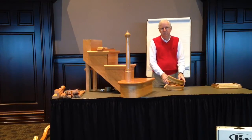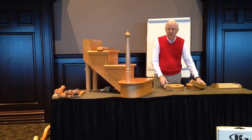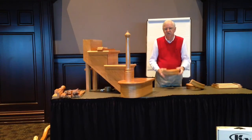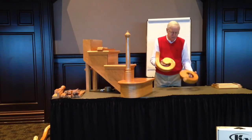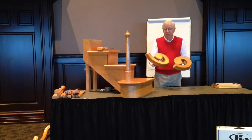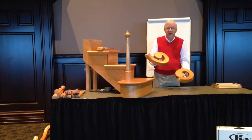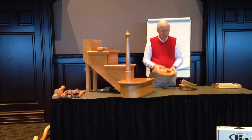It can accomplish two things. One is on a flared or curved stair, it allows the rail to continue a longer sweep. If you compare the two, you'll see that the ascending volute — the one on the left — makes a longer sweep, and it has the advantage of also placing the handrail a little lower.